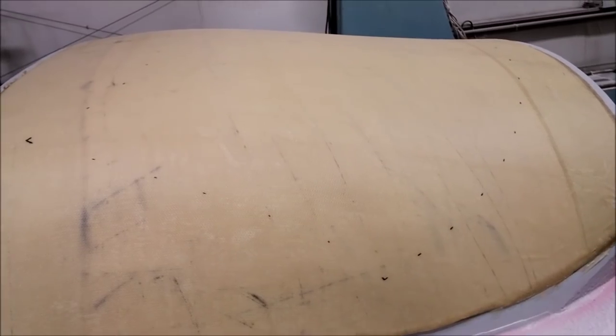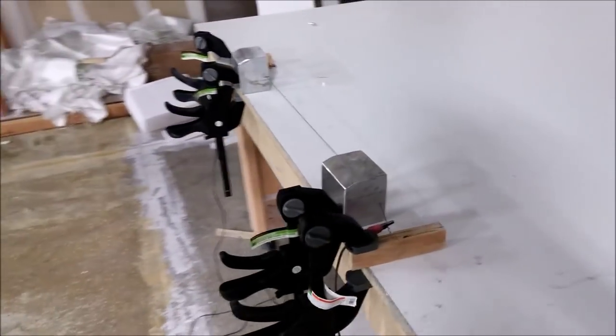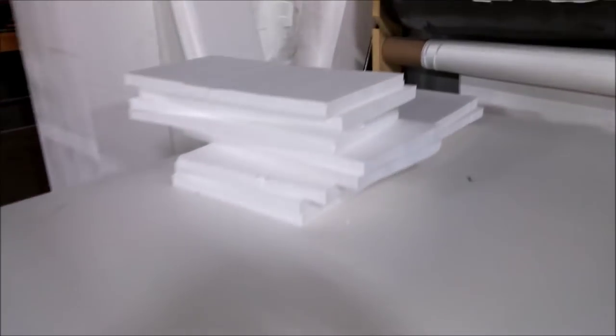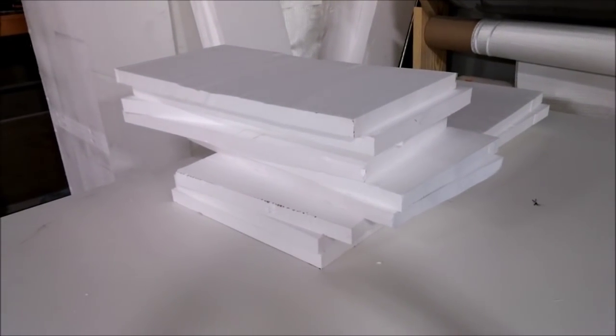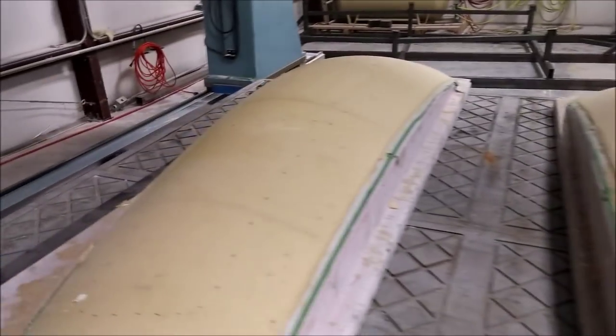Welcome back — here's the update for Monday and Tuesday. We're looking at the mold for the front windshield. I put it back under the machine and ran it around with a marker, laying out the actual dimensions of the window so that when it's being laid up in the mold, the people laying it up will be able to see where it goes. Here we're setting up a hot wire so we can cut some foam into thinner bits for bracing. We're going to be ordering some thinner foam so we won't have to do that.